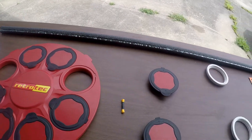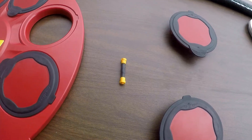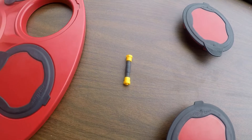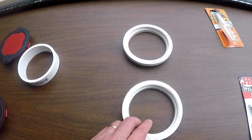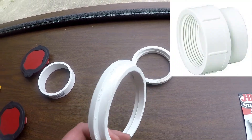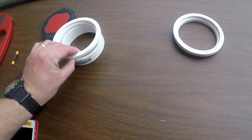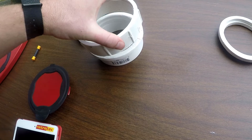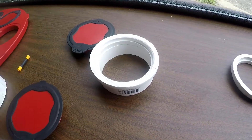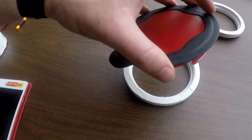I'm also going to use two range plugs from my blower door — my 5000 model — and a Retrotech hose connector, which will be where I connect my hose to the box. These two pieces here were four-inch clean-out adapters from the plumbing aisle at Home Depot. I took them and cut the bottoms and tops off, giving me a nice flanged opening that I can set in the top of the box and then set my range plug into.